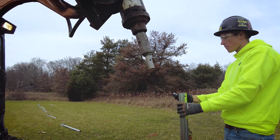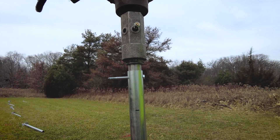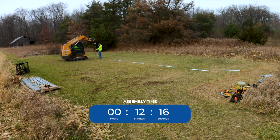The next step is to take the helical pile that we just assembled and attach it to the skid steer auger attachment in preparation to screw it into the ground. Next, you'll install the helical posts at each location that you've just laid out.